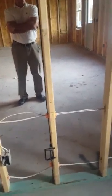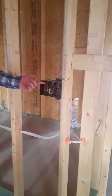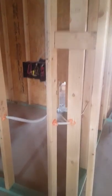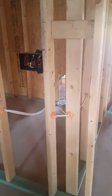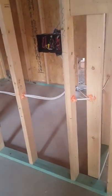You have a ceiling fan overhead, so ceiling fan pre-wire, 3 switches. Two of them are going to be for that ceiling fan, one for the light, the blades, and then the third one's going to be for the switch receptacle within the room, so that when you have a lamp or whatnot within the room, it's going to control that. So we can just buy a regular fan with a light, and it'll be fine. Yep.